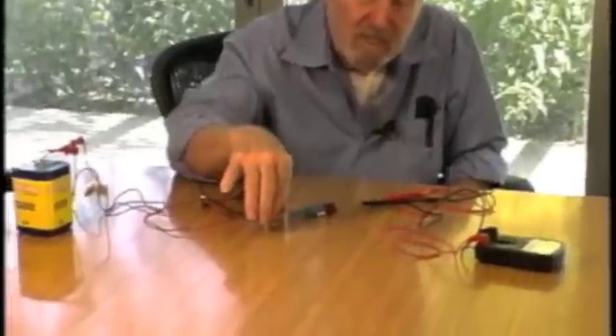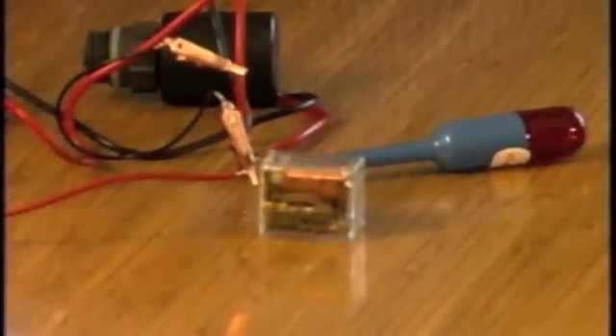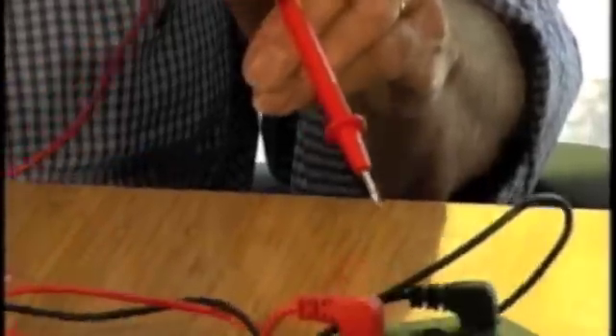The main advantages are speed. If you look at this little relay here — it's an ice cube relay — these are used throughout industry. The example I have here is with elevators. There may be 50 or 100 of these in one elevator, and when you open the panel to test it, it's just thousands of wires to check. If you do it with a voltmeter, how would you find the correct wire behind it? You have to go to a schematic and find wire number so-and-so on such-and-such a relay, which has all these little contacts behind here.